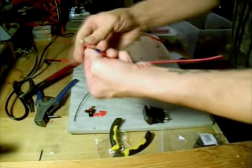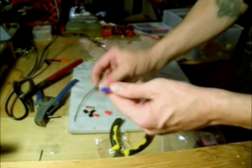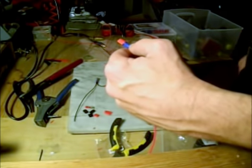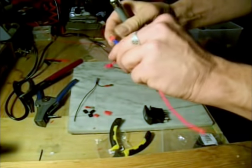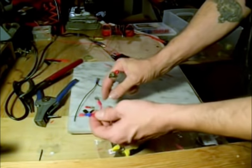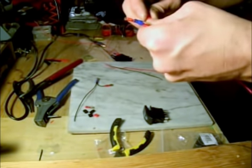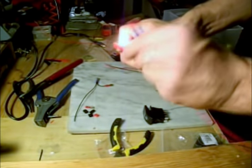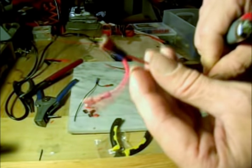So that's how those go together. Once you've done them, you take your heat shrink and put it over the end, then give it a little bit of flame and it reduces the exposed metal. So you run less of a risk of shorting something out by crossing the wire, having it touch something else, or grounding out. It's not necessary, but I like to do it on most of my connections just to be on the safe side.